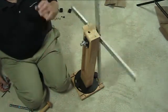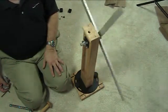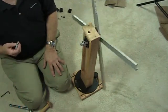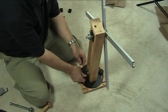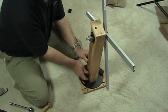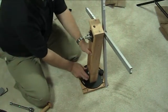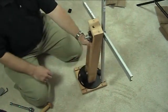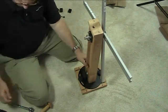When I normally do a spin test, I find that if I spin it real fast, I should get it to spin up around 20 times on its own. You also have a knob — it'll be a little different than this one, but it's not the production knob — it goes from the back into the I-beam into that T-nut we showed earlier. Make sure that's nice and tight, as that makes the unit one solid unit, prevents wobbling.